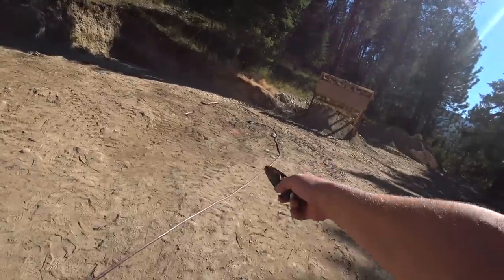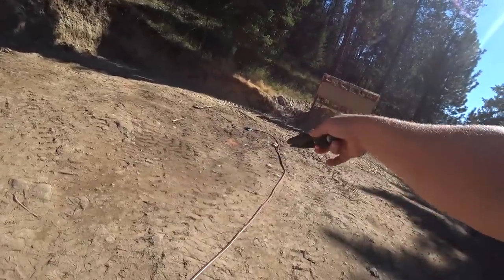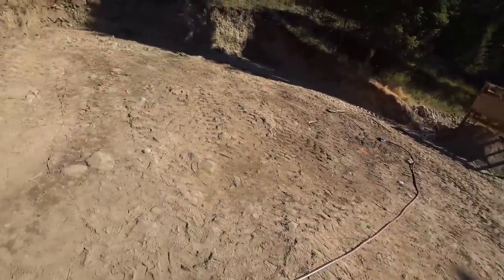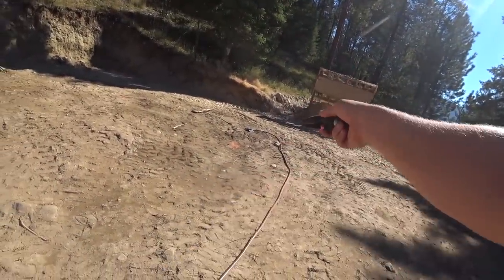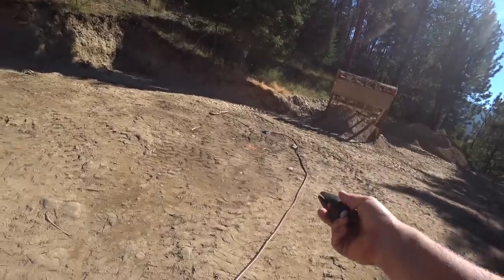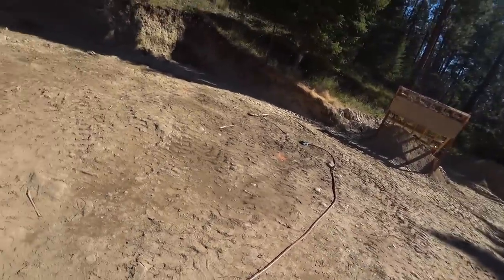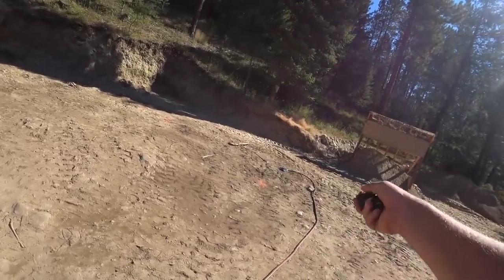So what we'd have to do is leave the footing out in a section of this front side here so that the concrete truck could drive in. Then after the concrete truck's gone, we'd have to dig and form up this footing in the front and then pour that probably ourselves. We really want to just focus on getting the footings done. So we've talked to the concrete pump folks and they're willing to come out and pump this footing for us.